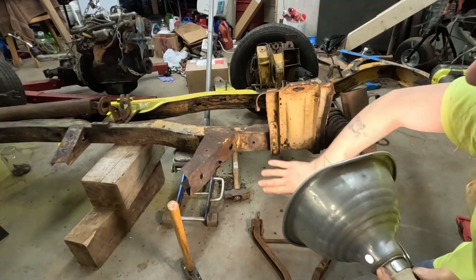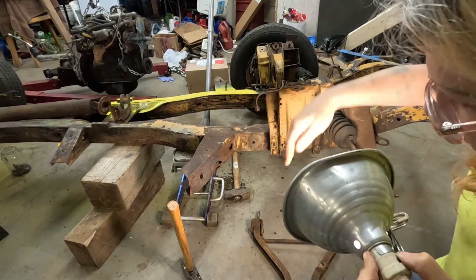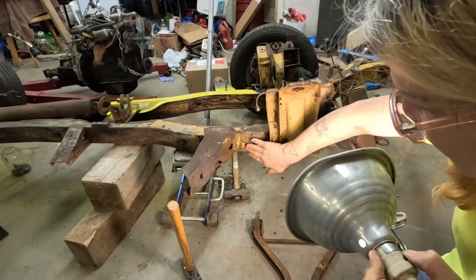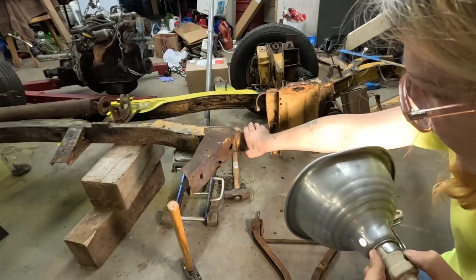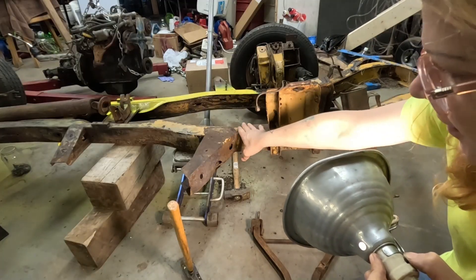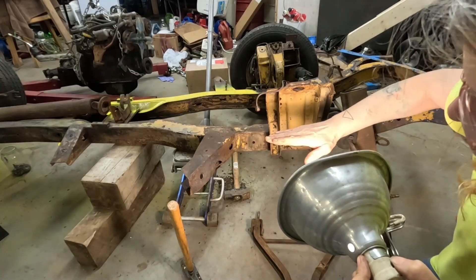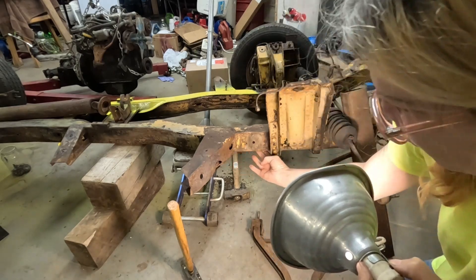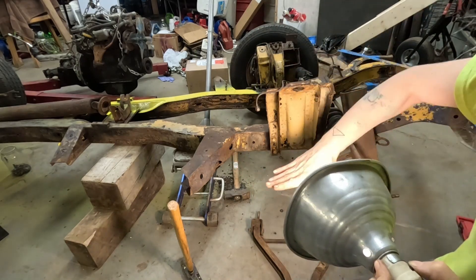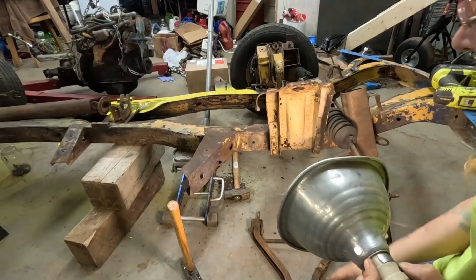It had bellied out the other side. I didn't like that so I hammered it back over here, and in the process of hammering it back there's this big belly here that I really don't like. That's a member in compression, so I'm not worried about the bottom — it is kind of wavy but it's in tension, it's still very strong. But this top here is sort of compromised.